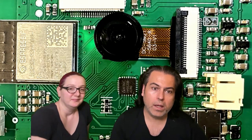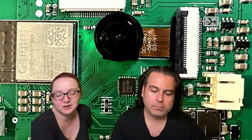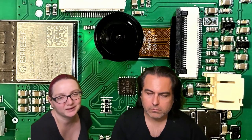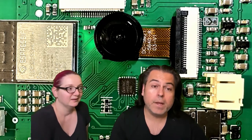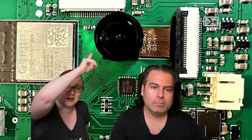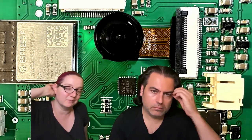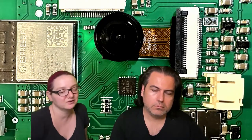This is way early — coming soon. Originally this was an S2, but for various reasons we had to revise it to use the S3. We're back on track now. We always wanted a little camera that was fully programmable with Python. This might be the only fully open-source camera. The ESP32-S3 with plenty of flash and RAM, the OV5640 camera, a TFT display, buttons, a piezo, and a battery — just need to get the battery stuff working.